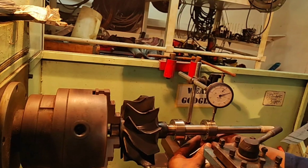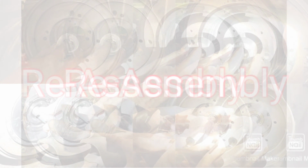Due to collision of combustion residue in the exhaust gas, the radial turbine blade might be worn. If the root of the blade at the exhaust gas inlet has been worn more than half, replace it. The entire wear from the root of the blade to the tip line will not affect the strength, and it can be continuously used unless it has problems in the performance due to inappropriate exhaust gas temperature.